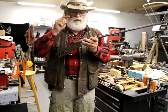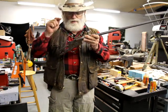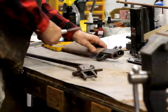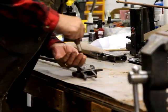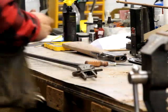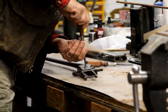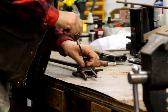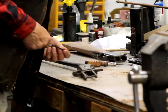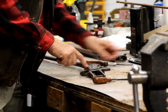So we're gonna take it apart, because the first thing I got to do is take this barrel off, and you have to take the internal parts out to unscrew the barrel. Let's start there. You want to try to get the right screwdriver for each screw — that keeps from damaging them. And that's one thing about this action I've noticed so far: the screws aren't damaged that much.